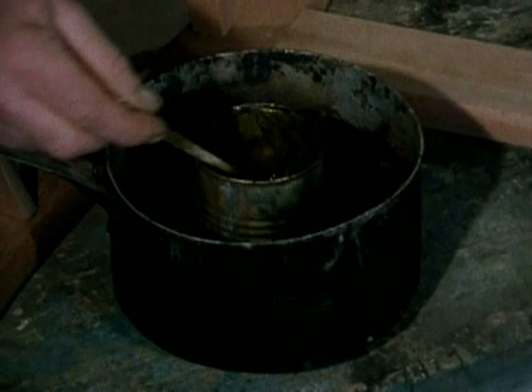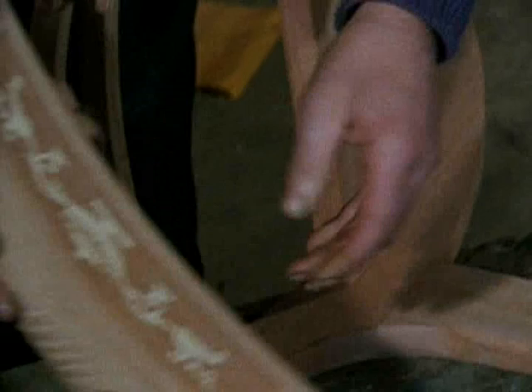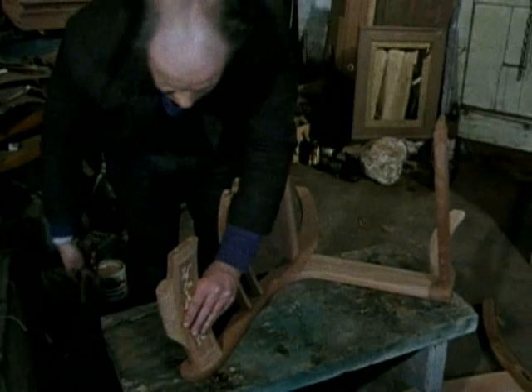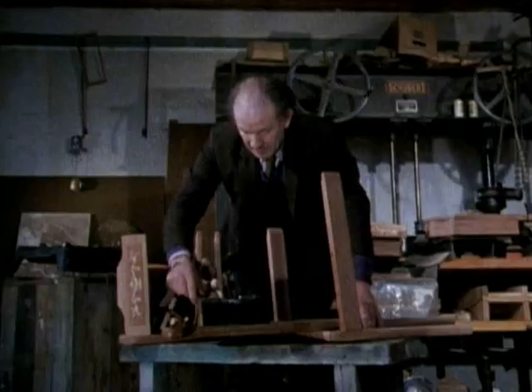The comfort and security of the chair you sit on depends a lot on this gluing and pinning. The dowels, those little promontories of wood, must be set in exactly at the right angle to meet with the containing wood. And afterwards the glue that spills over around the joint must be carefully wiped away with a wet cloth so that it won't mar the polishing process.